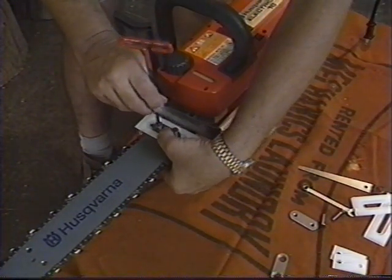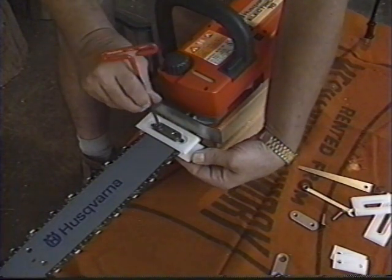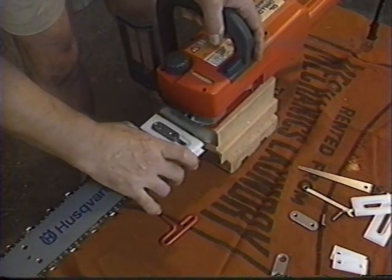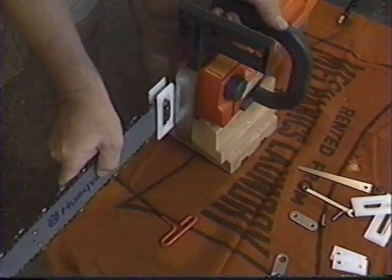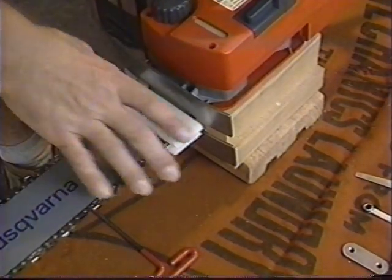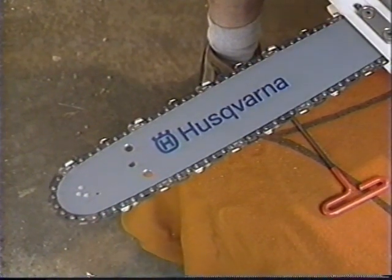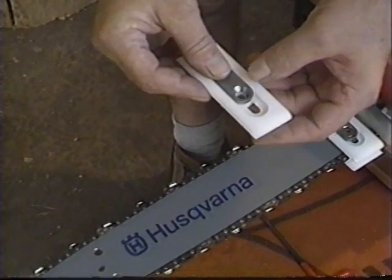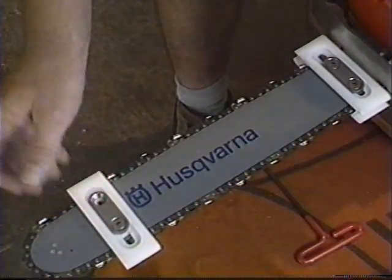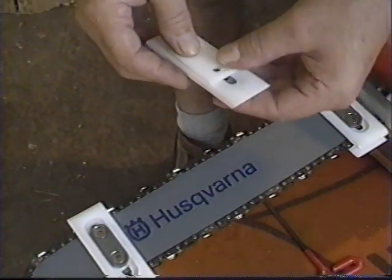Take the enclosed Allen wrench. And they're just somewhat snug. You can see that the guides are adjustable up and down. There's some leeway in the hole size. You'll also notice that they're protruding through the back. Before we do anything about that, let's go ahead and install the nose guides here at the tip. For this side, we've got a spacer, the guide plate, and the front retainer plate. The two screws. And a reverse of the order with the rear retaining plate.